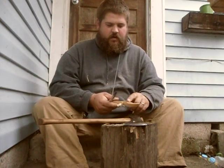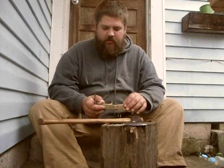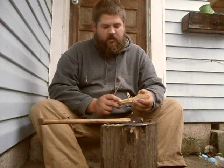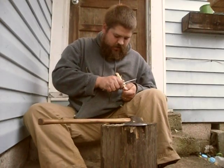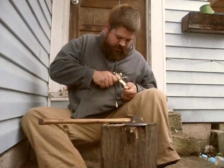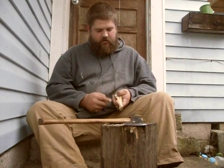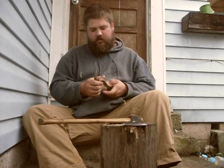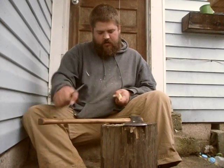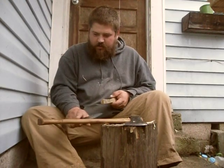You'll notice I haven't carved the bowl yet - I haven't taken a gouge and carved it out. There's a reason for that. When you're carving something, that's the thinnest part. When you want to move stuff around and flex it and put pressure on it, you want to leave that until last on a spoon, mainly because it has the most potential for breaking. I've not cracked one on a spoon before, but I have cracked a kuksa across the front and was able to salvage it because it only cracked off one ring. It's not something I want to attempt again.